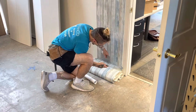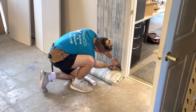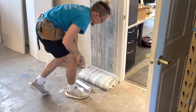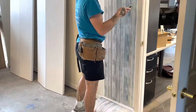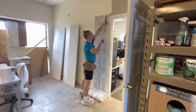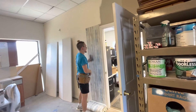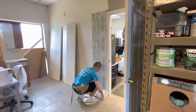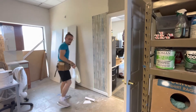He's going to trim that bottom piece and then we're going to see how that second piece goes up. The roll says 16 and a half feet, and we just did not quite eight feet, so we may have enough for two pieces. But with 16 feet and a 20-inch repeat, it's going to be tricky. We'll see where the repeat ends up.